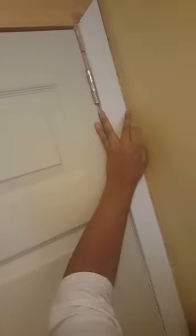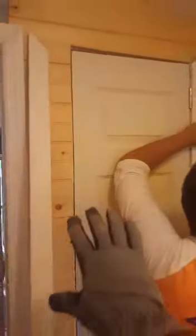We're getting it right where we want it. So this is a closet door and we're going to put the trim here. Now this gap is not my fault - it was already like this, so I have to fill this up with some sheetrock and then put a piece of trim on top. They're using flat trim in this house. I'm finishing this job and I should have taken some pictures before I got on it, so you guys don't think I made this mess - this was already like this. I need to put some sheetrock in here, fill up with blocks to make it steady, and then put my trim on top. This did not have a door.